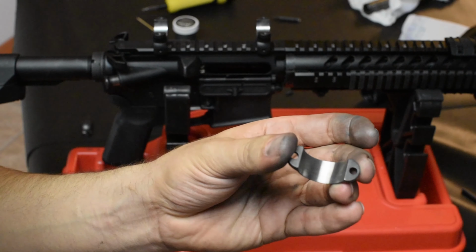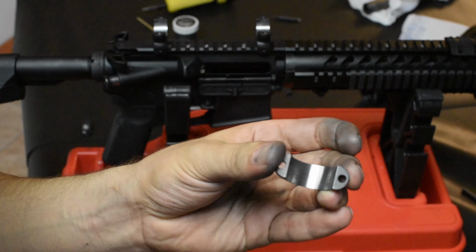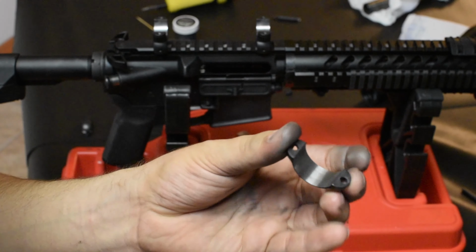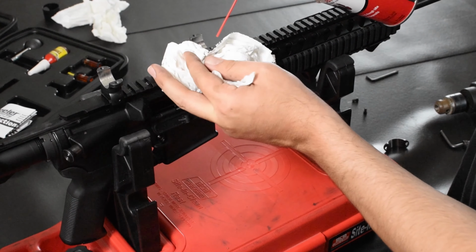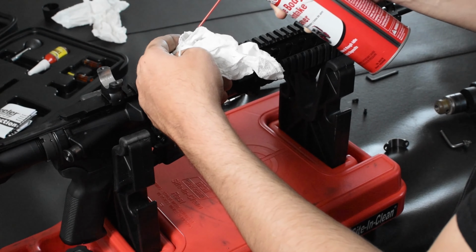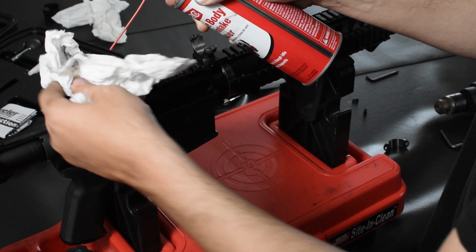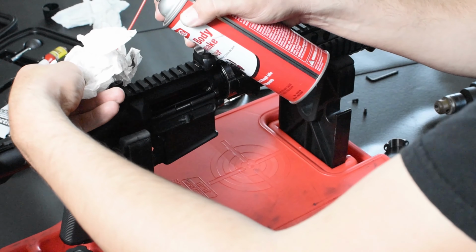You want to keep track of the front and rear sets because once lapped, they are no longer interchangeable. For proper alignment, front and rear sets have to be only mounted together. It may be helpful to mark which are front sets and which are rear. You can also re-blue the finish on the lapped ends to prevent rust and corrosion on the contact surfaces.